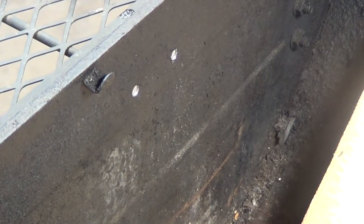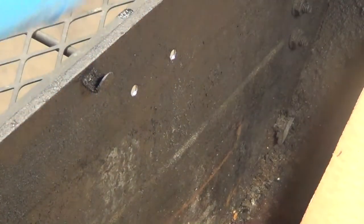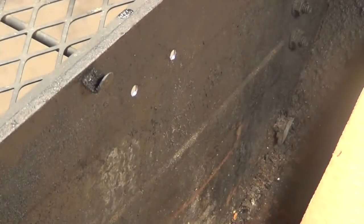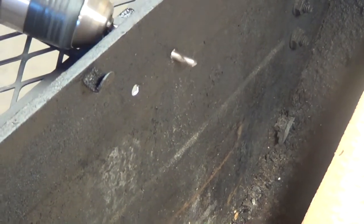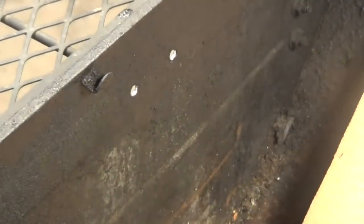There's still another obstacle. When I went to mount that bracket on here, the bolts they gave me were too big for the holes. So I had to get my drill and drill those holes out a little bit — not too much, just a tiny bit bigger than the holes. So drill out your holes or get smaller screws for it.